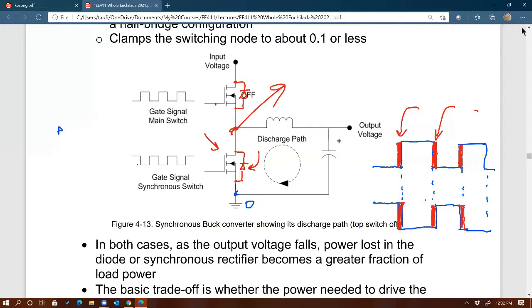You will see that some synchronous buck converters, or synchronous whatever, it doesn't have to be buck, don't actually deal with this problem. They would just say, okay, I'm just going to leave the MOSFET there with the internal diode. The reason they do that is that I'm pretty sure they did the calculation and decided that having that internal diode is good enough in terms of efficiency hit. We can tolerate that efficiency hit. If that's the case, then you can just leave it like this. Don't do anything else. But if this diode causes significant efficiency loss, then you definitely need to do something.